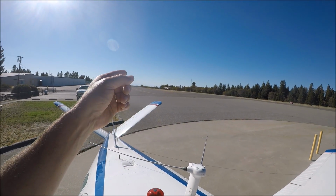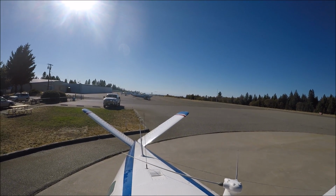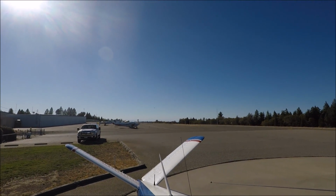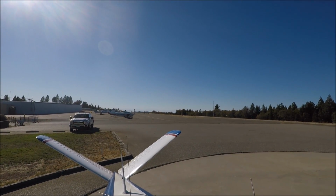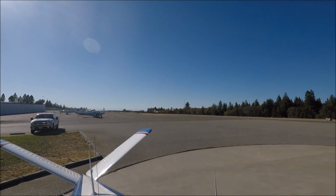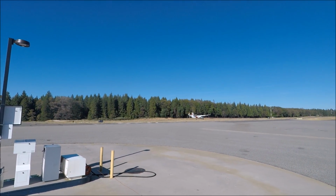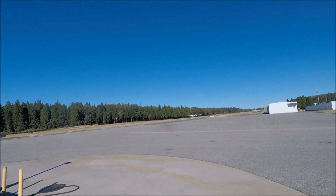Density altitude right now is about 5,000 feet. He's got a full load of retardant, well, at least 800 gallons worth. So he uses damn near all the runway. Meanwhile, he's still on downwind. And there's his base pattern turn out of the overhead. Just keep turning, turning, turning right to final. And right down in there is where it gets downdrafty and bumpy. Now these guys got the advantage of reverse pitch. Really helps them slow down. The engines aren't reversing, just the pitch of the propellers.